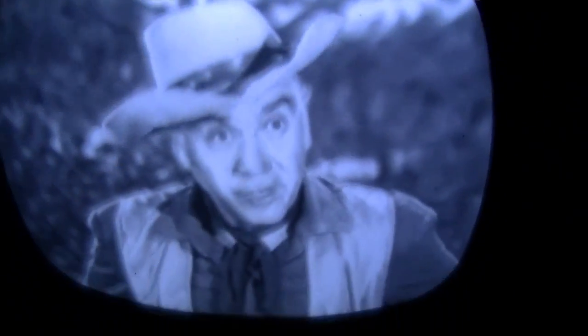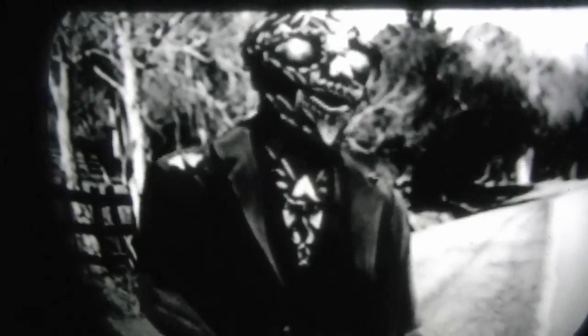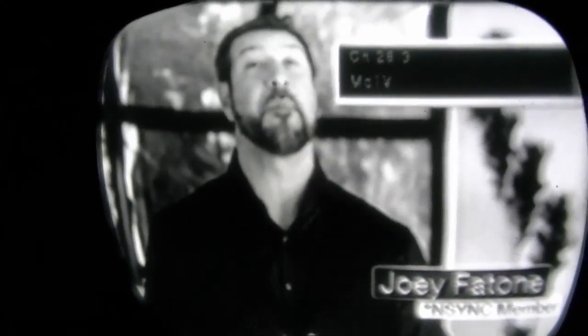So I've got some height and linearity issues, and I can't judge the picture too much with this picture tube because I know it's weak. I noticed when running with injected signals before that the longer it runs, it starts to look a little bit better, which is typical of weak tubes. You can see how bad the focus is. Let's keep this running for a while and see if things get better. Also the brightness is cranked up all the way — if I turn it down, the focus is considerably better. It's electrostatic focus, so there's nothing to mess around with. No ion trap, no focus coil, no focus magnets. One advantage to newer CRTs: electrostatic focus and aluminized, no ion trap.